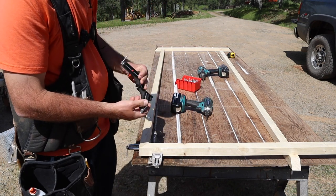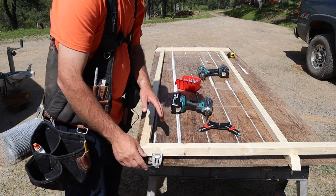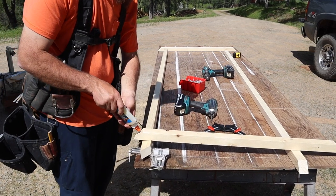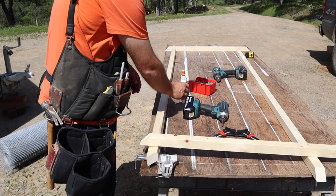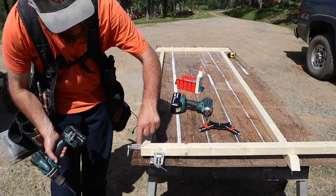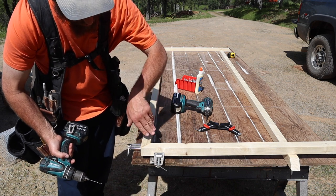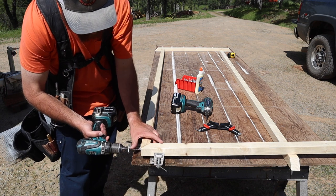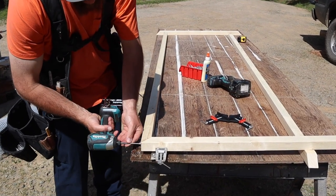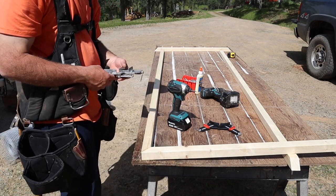I got these — I don't even know what they're called — like a miter clamp for a 90-degree angle. Before I screw it all together, I want to add some glue, which will definitely help a little bit. I personally like putting the screw on the header going through the header rather than going down from the header, because I feel like it adds a little more strength than gravity pulling on the screw. We'll just repeat that all the way around.